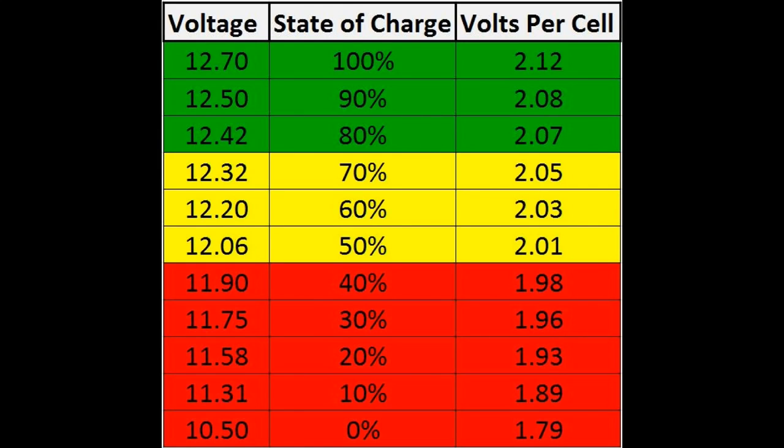Now, it's not the best idea to keep flooded lead-acid batteries in the house, but if you live in a northern climate, you're going to have to find a way to keep your batteries warm. Batteries will lose efficiency as the temperature drops, and they'll become downright useless in the dead of winter if they're kept outside. And you can pretty much forget about using the power you're generating in a system of this size to heat the batteries, because you're going to need more than you generate.